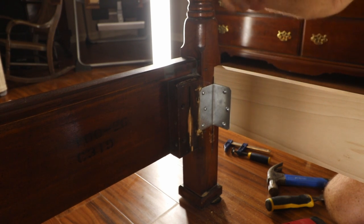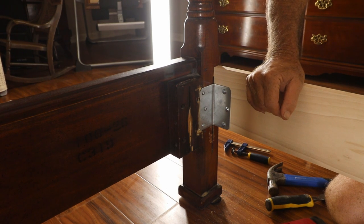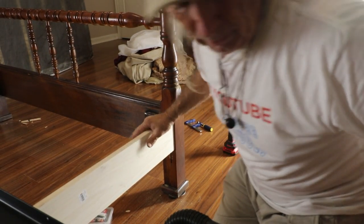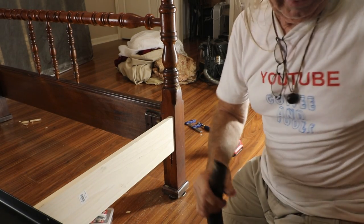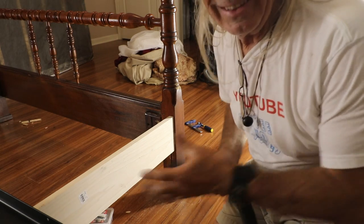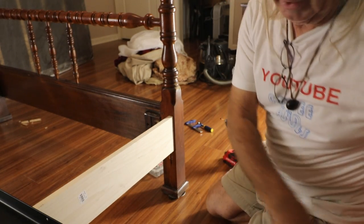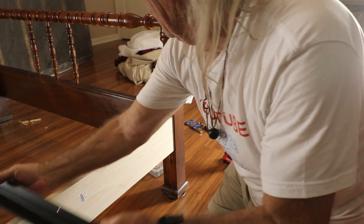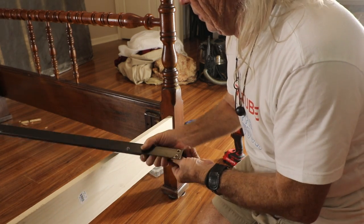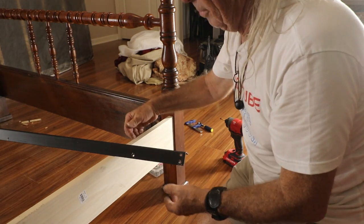When I'm doing this side the other side is moving around, so we'll do the same thing on the other side of the bed, then cut the rails and put them on the bottom. I've done all four corners now. Getting the vacuum out to clean up the cutting mess — otherwise the wife will kill me with this mess on the new hardwood flooring. I took the rails outside, used a hand grinder to knock the rivets off and get rid of the hardware. Then I drilled holes that are three-sixteenths — six holes per rail — and I'll be screwing these into the lumber.